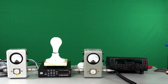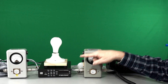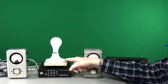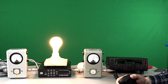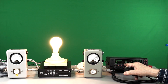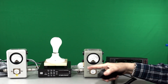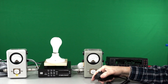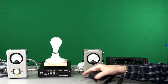I've got things connected. We've got the transceiver connected to the first Bird, through the antenna tuner — which is off — to the second Bird, and then to my fancy antenna. We've got about 100 watts and about 100 watts, roughly 100 watts. There's not much in the way of cabling links at this point. Let's see what happens when we turn the antenna tuner on — how much loss is there?